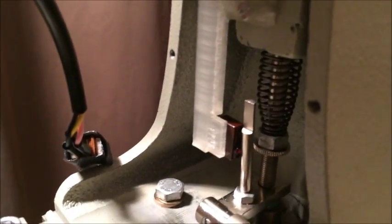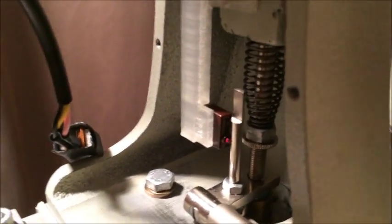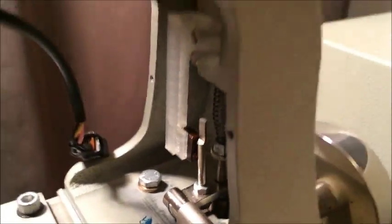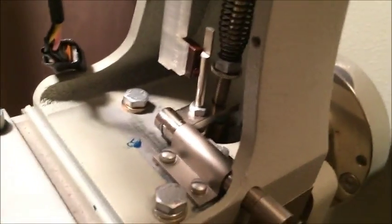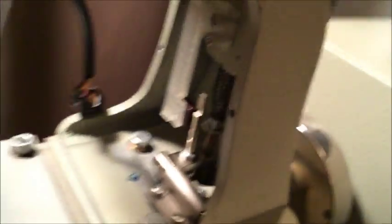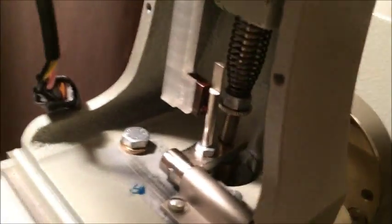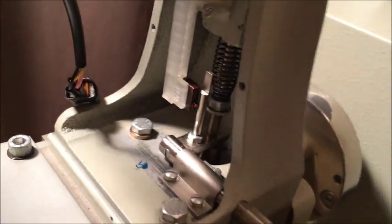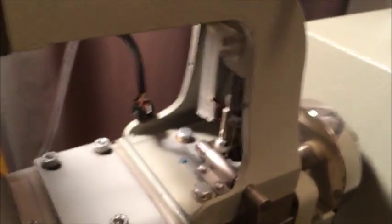You can see and you can hear the click. It's nice because you can actually hear the click — you know it's happening. Sometimes that switch would get bent out of shape, the stop wouldn't work, and I'd be working on a cut and my head wouldn't pop. You'd have this moment of 'what the fuck.' Now you hear a satisfying click — if you hear that click, you know you're good. This is ready to be soldered into place and closed back up.